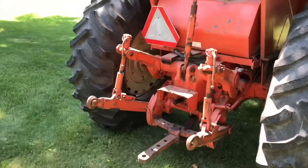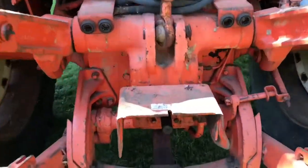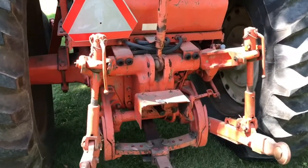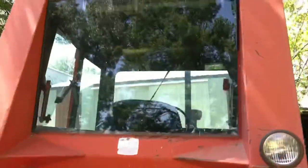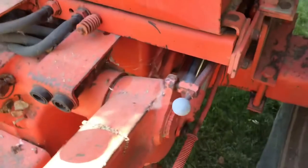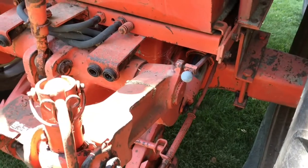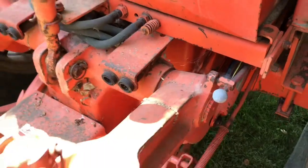This one's got three-point. They all had a 1000 RPM PTO, breakaway couplers, two remotes — nothing spectacular. This lever here was actually for your three-point to raise it so you didn't have to keep getting up into the cab when you're hooking something up. You could just pull on that and it would raise your three-point up for you.